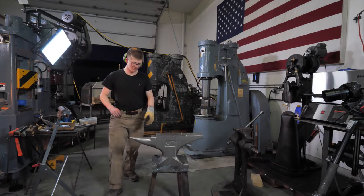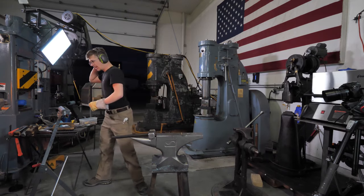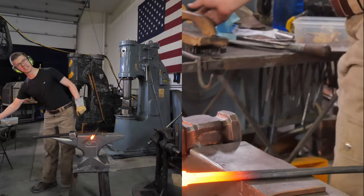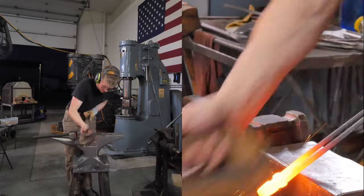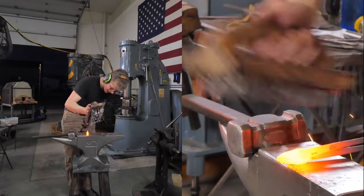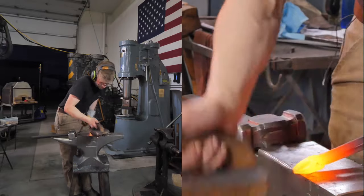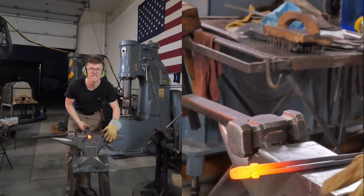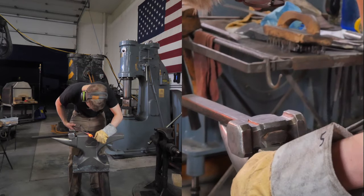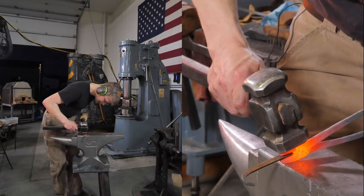So what I was saying is this. When you make a pair of tongs, never make a pair of tongs. Okay, I'm speaking in absolutes here, it's probably not responsible. I don't recommend making a pair of tongs to suit round bar. Make your tongs to suit square bar, because a pair of tongs that hold square will invariably hold round. Fascinating. Just fascinating. So, here's what I'm doing. Making the jaws fit inwards. Hammering.